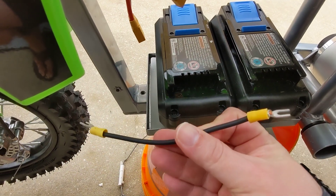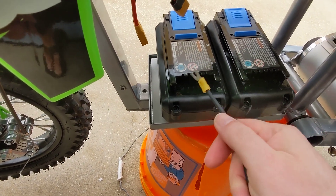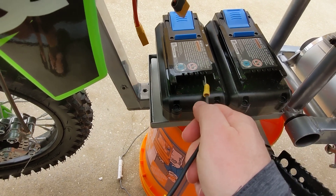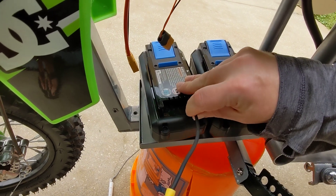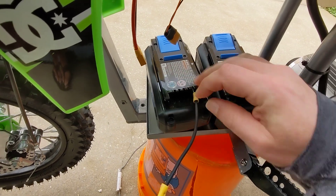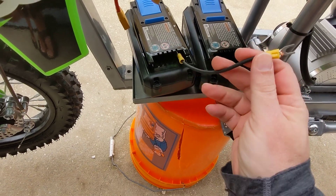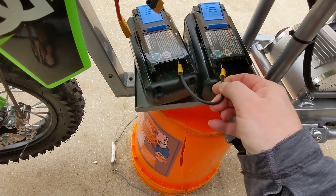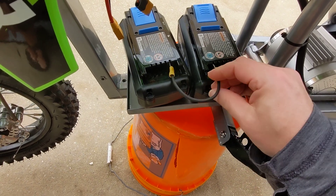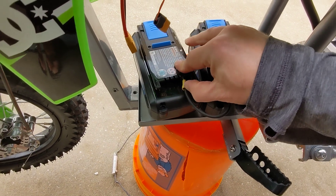This particular connector is just two of the same thing. Now you need to be careful because 72 volts is dangerous as hell, so don't pop yourself — don't touch both terminals at the same time once you connect these. These are each 36 volts. So positive goes to negative right here, and these just clip right in — just slide right in, just like that. Tighten it up.